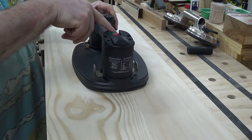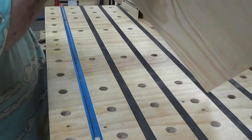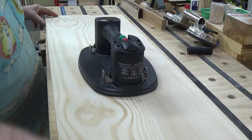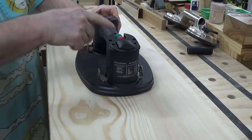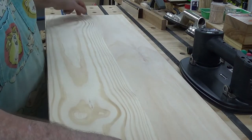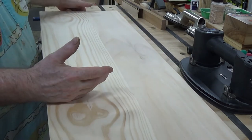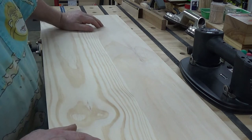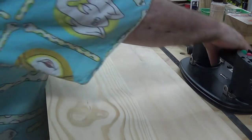Put it on there — that's been switched on. Turn it on, you'll hear it sucking away and there you have it. Now this is going to continually keep going and it doesn't reach maximum pressure. When I press the green button it should redo it, but it virtually releases. The main reason is this is a joint board — there's a seam down the middle — and because of that seam, air is being sucked through between the two boards.